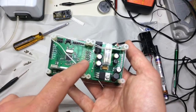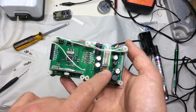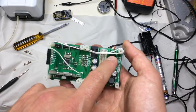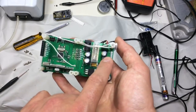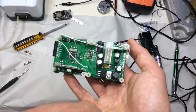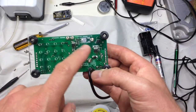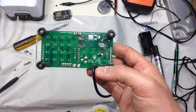To this side of the board — a separate board, connected via jumpers — there's a high-voltage power supply. There's also some circuitry on the bottom supporting it. It creates about 180 volts from the 12-volt input. There's also a fuse, and just to this side a 5-volt power supply using an MC34063A chip. The high-voltage supply uses that same chip in a boost configuration, while the 5V supply uses it in a buck configuration. On the underside you can see the surface-mount MC34063A switch-mode power supply chips, along with surface-mount diodes, resistors, and capacitors.